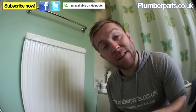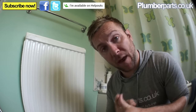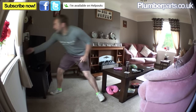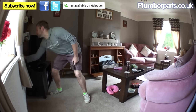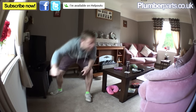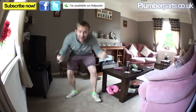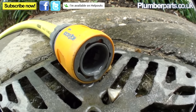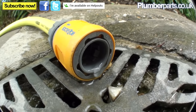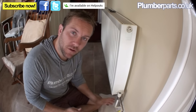If you find any radiators that aren't draining down properly, make sure the lock shield is open and also that the thermostatic radiator valve is open. In the living room on the ground floor, we undo the bleed — see, that's now sucking, so we know the water level is getting down. After about 20 minutes the hose has pretty much stopped draining, so the system is drained down. You can do whatever work you want to do on the system now.